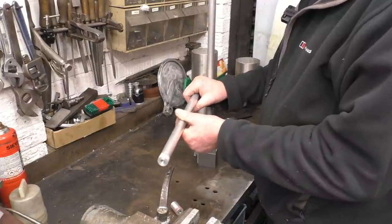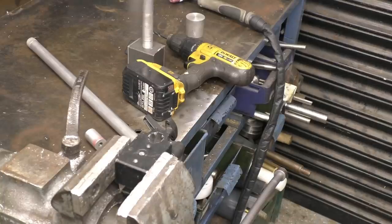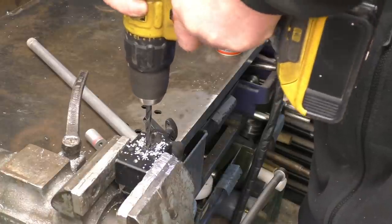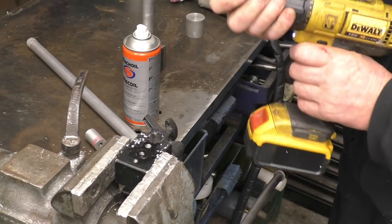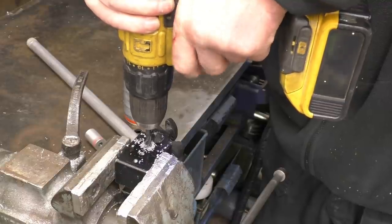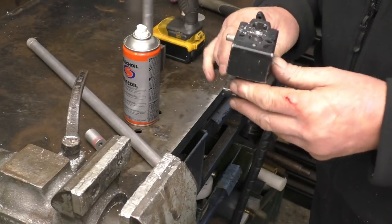I'm not quite sure - I will see what that feels like when it's more under there. But it's certainly a good start. It's obviously fully adjusted up and down and the mag basically just twists around. I think we're just going to do all this freehand. 6.8mm to do this - 8mm machine tap, some decent threads in there.